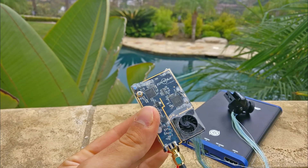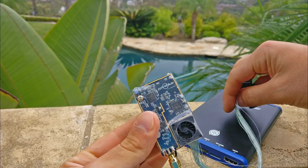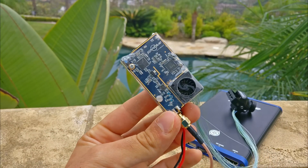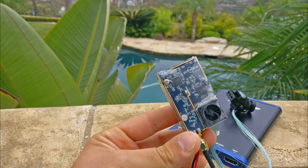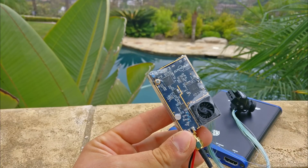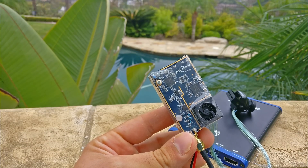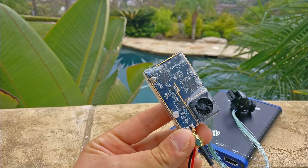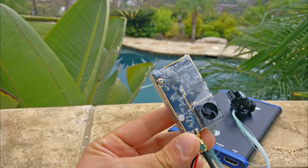Let's compare it to Connex, because that's pretty much the only thing out there to compare it to. This is another low-latency FPV-grade HD video link — so it's not like DJI or any of those Wi-Fi products. This is a low-latency system, meaning under 50 milliseconds. It's been calculated at about 40 milliseconds of latency, which is more than acceptable for plane flying or high-altitude flying — though not really for 100 mph at 5 feet off the ground.